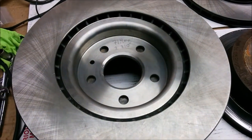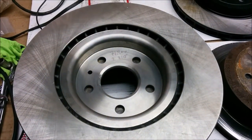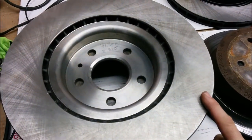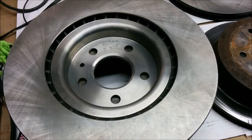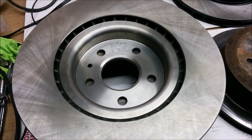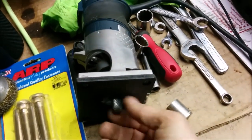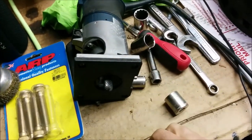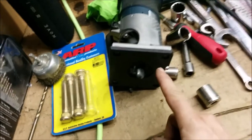I kept thinking of different ways to do it. One idea was to make a rotary table out of plywood, center the rotor with a dial indicator referencing the outside diameter, and attach something to hold an electric die grinder at 90 degrees to spin around and open up the bore. When I was researching burr bits for a die grinder I realized they came in quarter-inch shank — and that's when the light bulb went off, because that's exactly the shank a woodworking trim router takes.